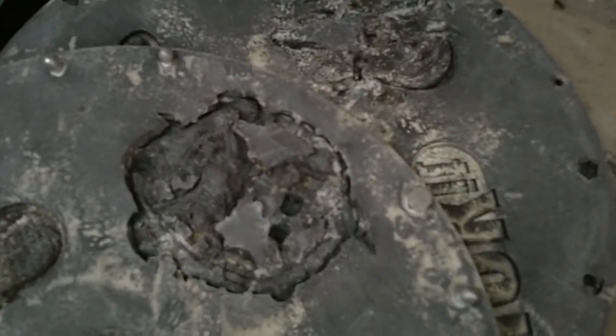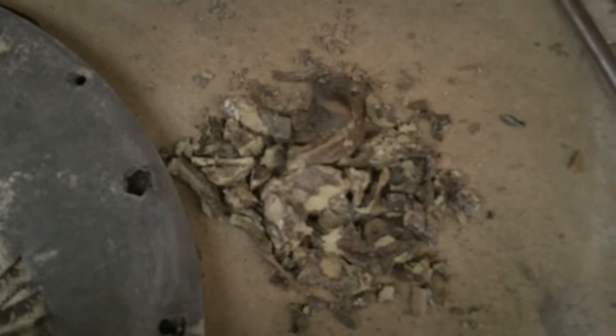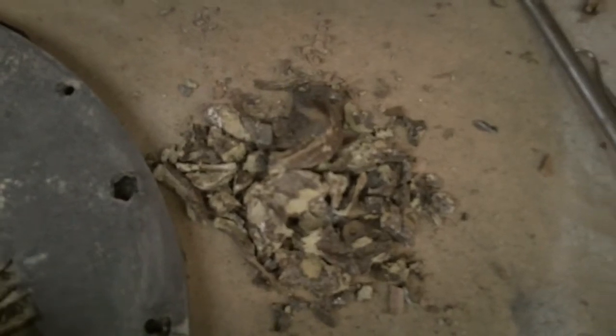That's just about all the debris out of the mould. You can see the two halves of the image there — looking good so far. Obviously won't know until we cast it. Not looking good for the model, however — that's what's left. I came to the conclusion many years ago that on a model that intricate, you can't really expect to get them out in one piece. So I really make them to be destroyed within the mould. As long as the socket is clean, that's all I can expect. To try and get them out, I'd have to use silicone or a softer rubber and be far more gentle, which has problems as the silicone isn't so robust. So I designed it just to break up in the mould now.